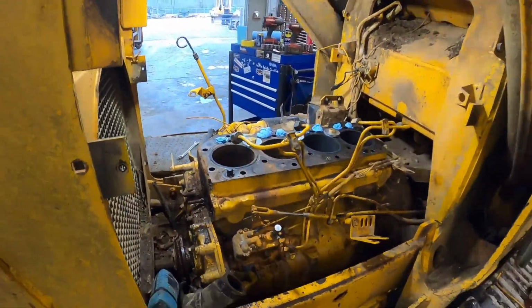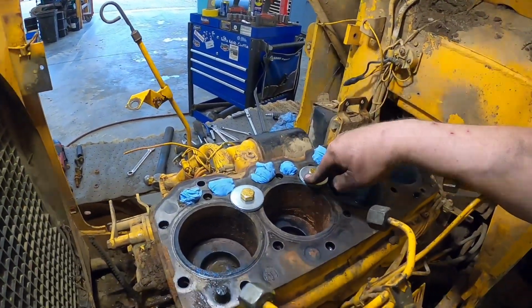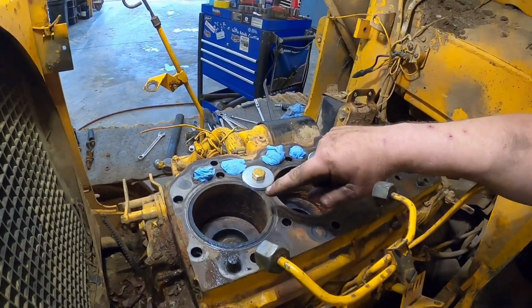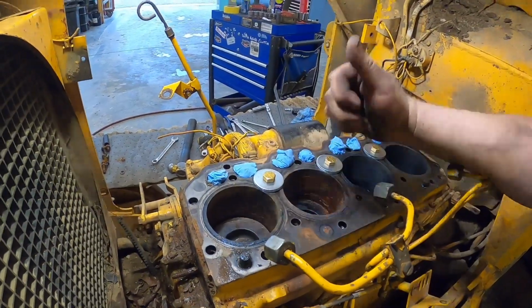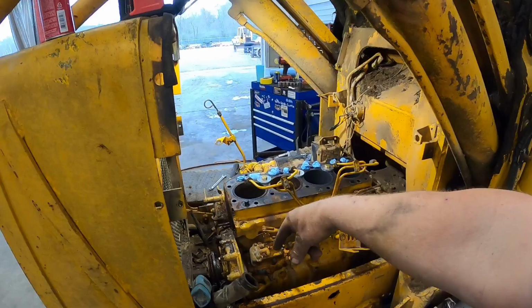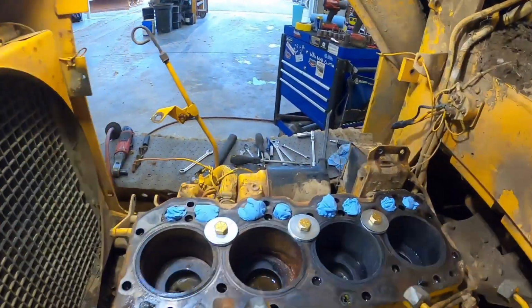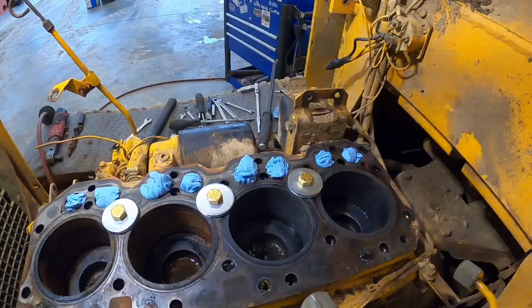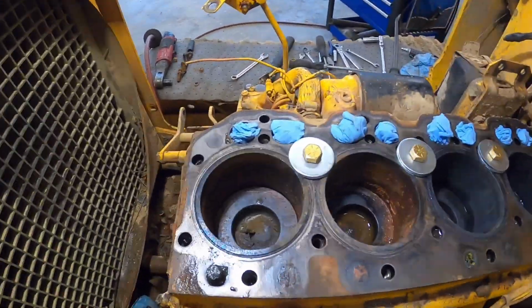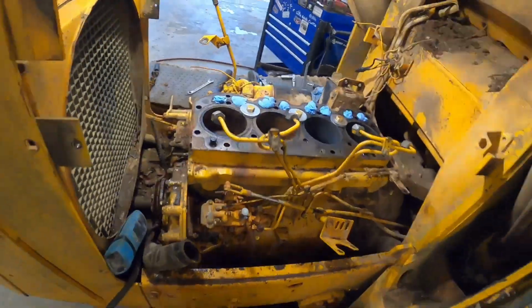All right, Kevin got the water pump off there and got some bolts holding these cylinder liners in there with some washers. So if you go cranking this motor, these things being stuck, you can actually just crank these liners right up out of there. There's nothing holding them. The head's what holds them down. There's some O-rings down below that separate the oil and the water, and we got those in there. He's gonna give them a little snug down, and then we'll see if we can get in there and clean some of that nastiness out.